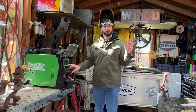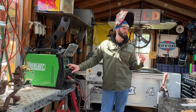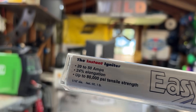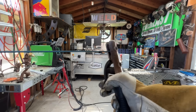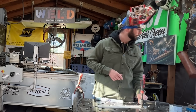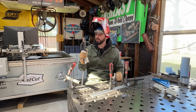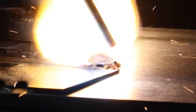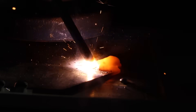The viral clip of Chris doing the razor blade challenge with stick had his machine on zero because it still welded at a few amps. This machine goes at a minimum of 10 amps and these rods recommend a minimum of 20. We're going to go to the minimum and see what happens. These Easy Strike electrodes are 1/16 inch diameter, so they're pretty tiny. We're going to tack them together with TIG first and then stick weld them. We've got the hot start, arc force, and amperage all as low as they'll go.